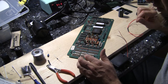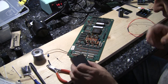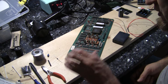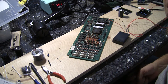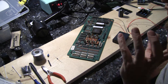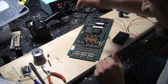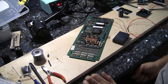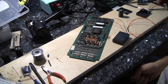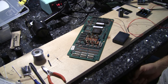What I'm going to do here is I'm going to set up a remote battery pack. One of the most common problems with all pinball machines is damage to the main processing unit from batteries that are mounted on the board, that over time leak this electrolyte which gets in here and just erodes away at the traces. It just gets sucked up onto the circuit board and follows all of the paths and goes into the components and starts to destroy them and corrode everything.